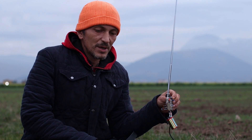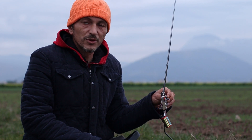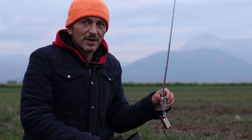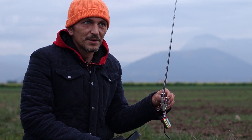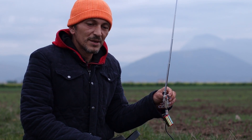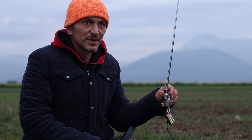Let's listen quickly to what I can hear right now. It's a bit noisy — the receiver is much more sensitive now. In the past from this place I could not hear the electrical wiring interference, the 50 Hz hum. Now I can. I have two electrical poles about 150-200 meters away and I can still hear the hum, whereas with the older version I could not. Last night I also got to listen to some electrical discharges from lightning around 1 AM.